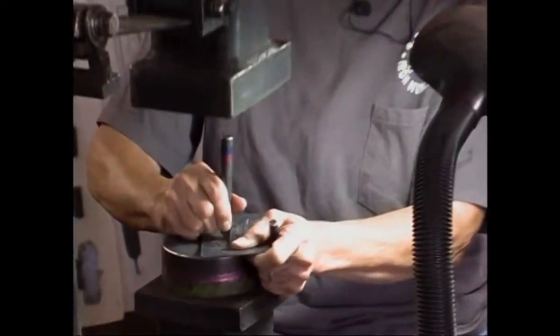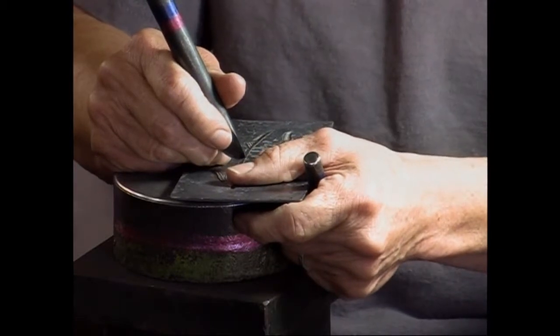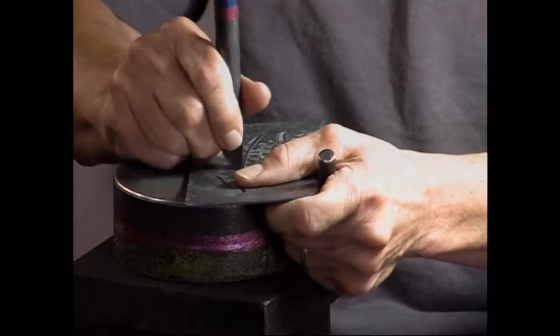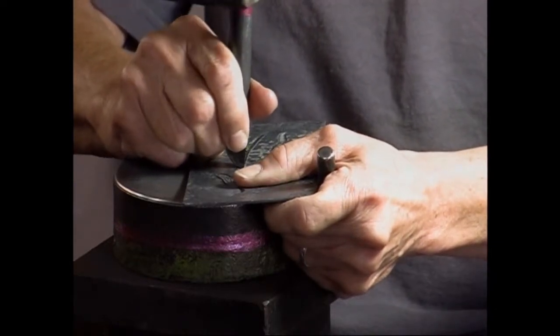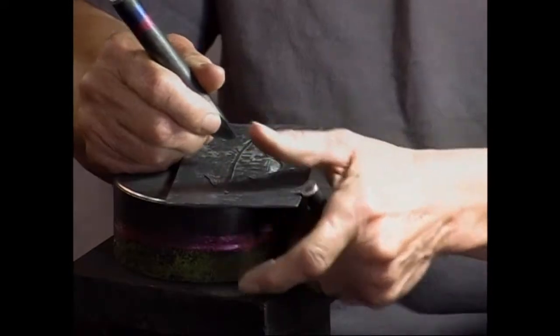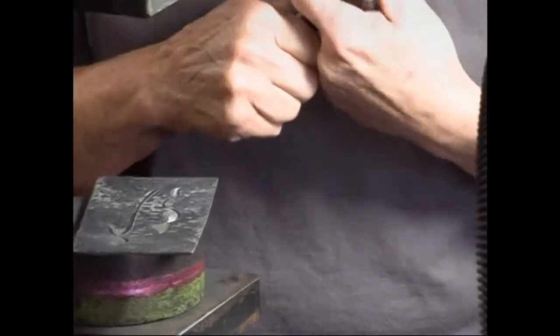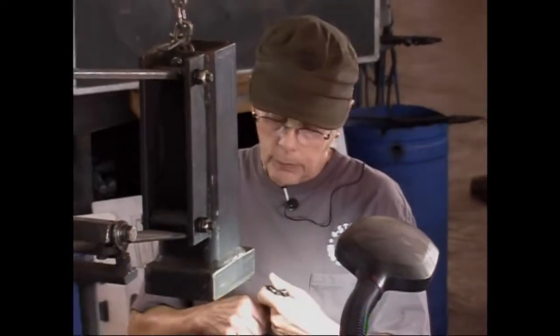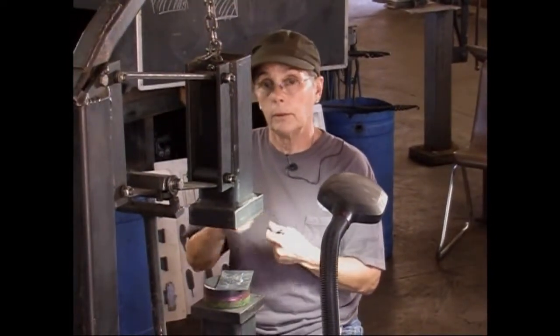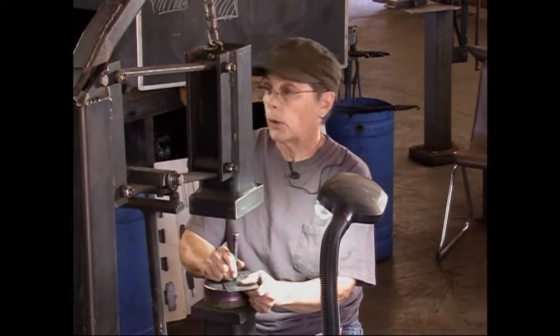If you use the traditional finish of boiled linseed oil, Japan dryer, turpentine combination, which a lot of the Gothic type stuff is finished with and Yellen used, and you use any colors like your tempering colors as part of your work, the linseed oil darkens over time and actually turns to a brown color. So you lose all the colors that you've put on. Somebody said, no, actually what you're losing is your oxidation colors. Those have disappeared. So I stripped the piece with lacquer thinner. The colors were still under that finish. And that's why I don't use that anymore. I mean, it's an excellent finish, but it depends on what you're using it on.